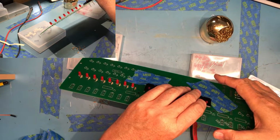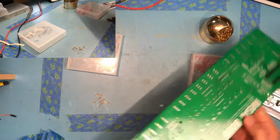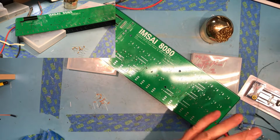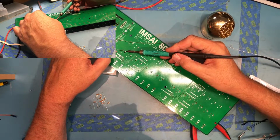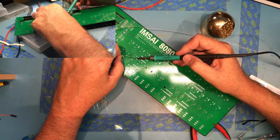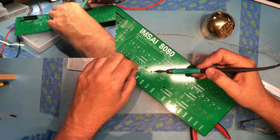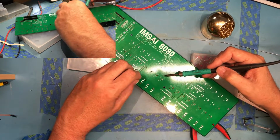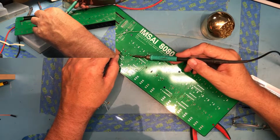Check them with the guide here. They're all flush. The spacing looks good. I think we can walk the other set of pins and solder those. I recommend following, as I said a second ago, his assembly order. The assembly rig used to be able to be slid out from the current set of LEDs, and if you tried putting the LEDs in, I guess you could rotate it around, but you don't want to get it trapped by changing the order dramatically.